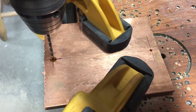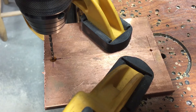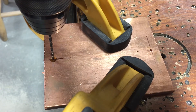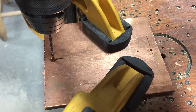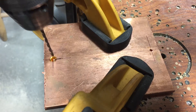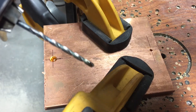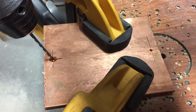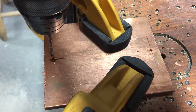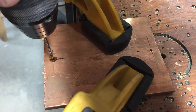There's been a lot of discussion lately about drilling and tapping copper, so I thought I'd do a video and show you my method. This is a number 36 drill and we're going to do a 6-32 hole. I always use a little oil on the bit because the copper is soft and has a tendency to stick, so it makes it cut a whole lot easier.